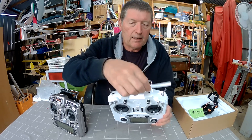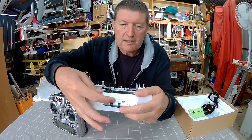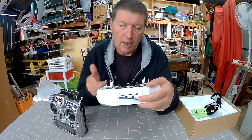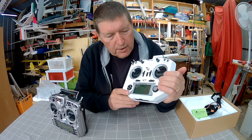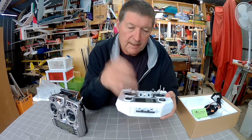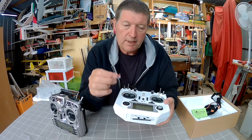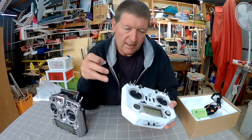We have an earphone port and a trainer port, and in the bottom we have an SD card slot and a mini USB slot for connecting to your computer, transferring and updating the firmware, transferring log files, and programming models using OpenTX Companion — which is another brilliant feature of these OpenTX supported radios. For the Taranis QX7, if you want voice commands and to record logs, you do need to put a micro SD card in. It doesn't come supplied with one. You download the contents from the FRSky site, and you can also download different accent voice commands as well.